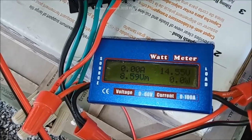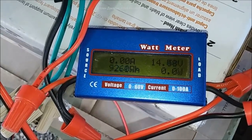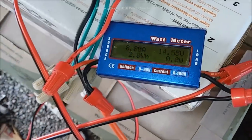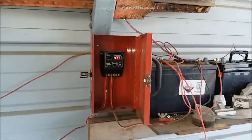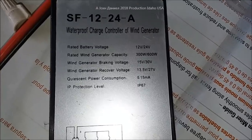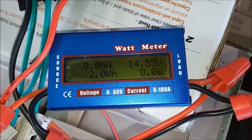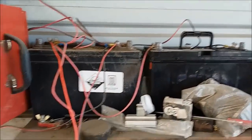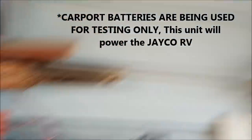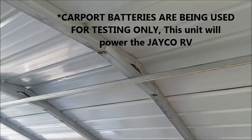There's no wattage or amperage in right now because it's on brake, but it was giving 134.2 watts, 2 watt-hours already, 9.61 amps at 14.55 volts. That charge controller shuts off at 14.1 and this one goes on brake at 15 volts — though it's not very accurate since it's showing 14.55 and it's already on brake. Those are the two old restored batteries — one is about five or six years old, the other closer to eight years old — and they run all the lighting in my carport: a very bright, big long light strip.